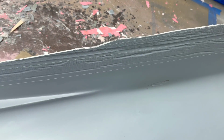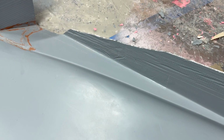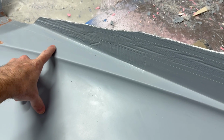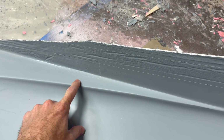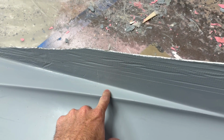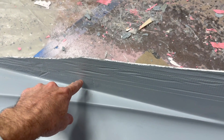This is another great example of that duct tape being used. This was on the very bottom of the helicopter, which was a real pain to get to clean up. And so I basically just stuck to the areas that I knew I needed the part to be. So you can see here my carbon part will come over and sit on this nice pretty mold face. I need about a 1/2 inch flange to come down this face, and so you see that joggle in the duct tape. So the carbon will stay on the pretty surface, and then I'll end up just using the bag out to this surface, and so this really doesn't matter.